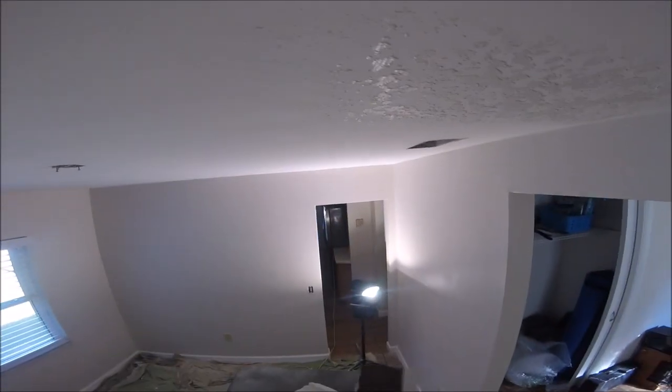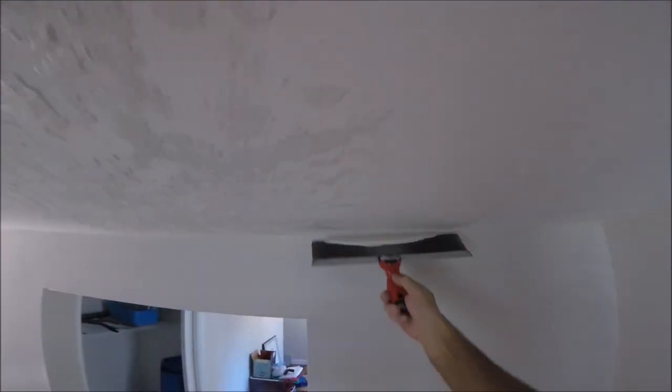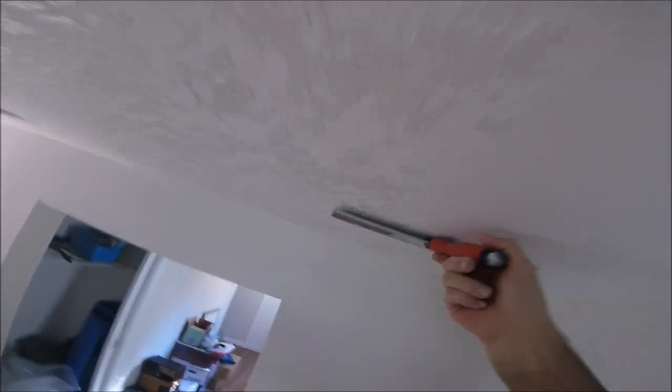You'll find the joint compound is perfect on how it grabs your skip trowel. You're trying to skip trowel where painted surface tends to slide a little more. You gotta work it a little more. This grabs just how you want. So I'll get a big enough area, pretty much just use all the mud, and then I'll knock it all down from the opposite direction.